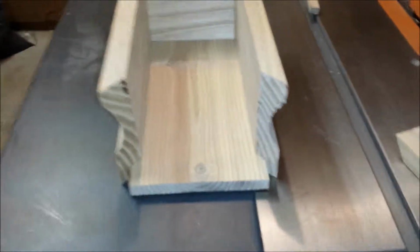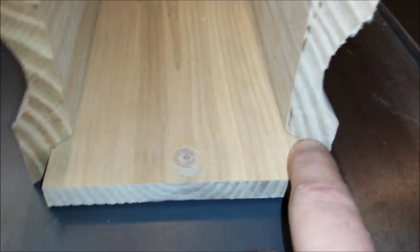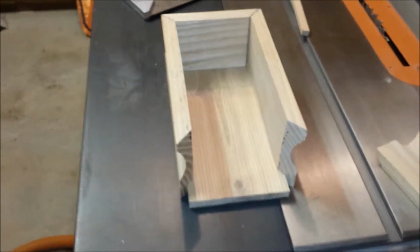Now for the length of our base plate, same idea, except now that we have 2 corners all squared up, we can actually just put it together and put a mark right where those dados end there. So we'll go and cut those now. Remember, if you can mark something without having to measure it, go ahead, but make sure that that is an accurate way of doing it, or you will end up with a miscut.